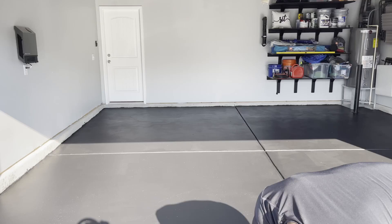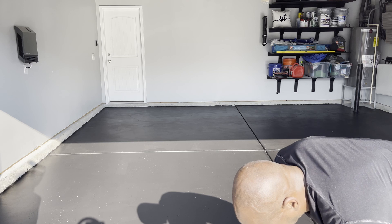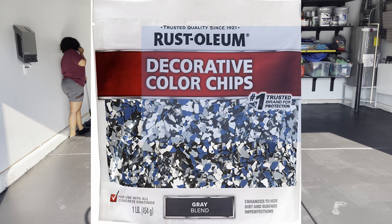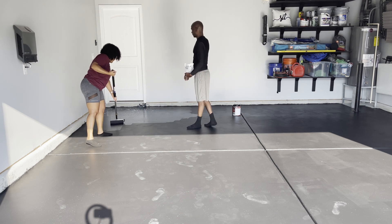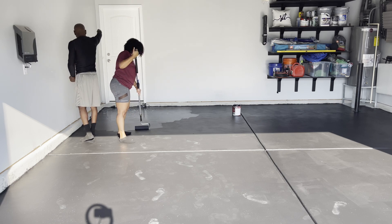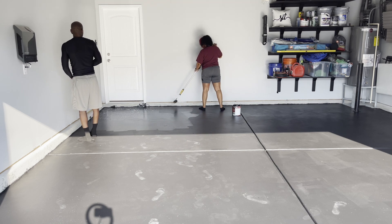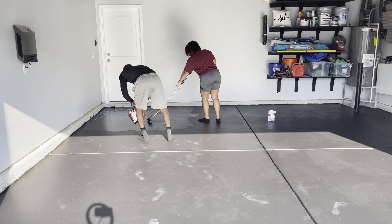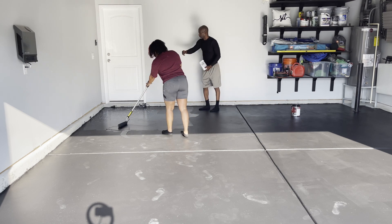Here I am just finishing off the final quadrant. We put on two coats and allowed it to dry completely before moving to the next step. When you're in the hardware store, go ahead and look for the flakes of your choice — my husband chose black, navy, and silver, probably because it closely matches the Dallas Cowboys colors. What you see me doing here is putting on the next layer of paint, and while the paint is wet my husband is dispersing those flakes. The idea is that you throw them up high and allow them to trickle down. We did not want to cover our floor with flakes where you would not see the black paint — but that is up to you.